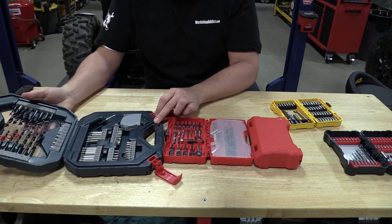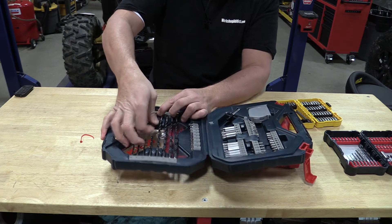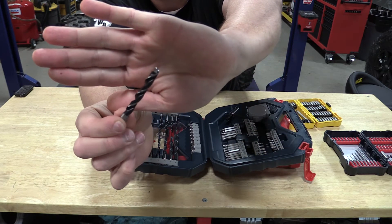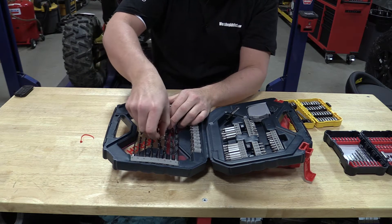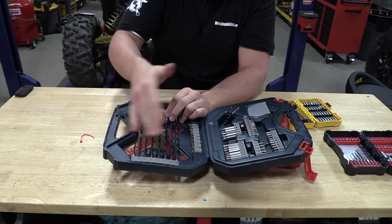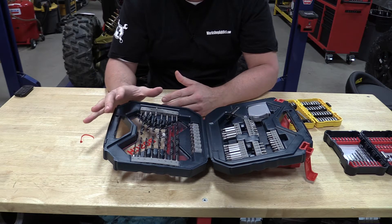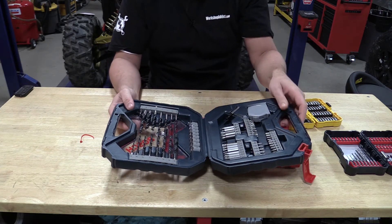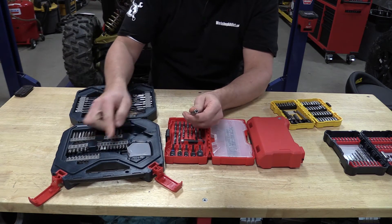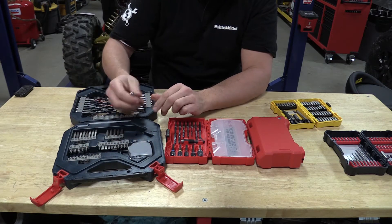If you're looking at a wood kit, this Bosch kit was very inexpensive and comes with a different style of drill — you can see the point at the end that works out well for wood. That's not going to work out well for metal, though they do give you a normal set of drill bits for metal. If you're drilling anything outside standard cold-roll metal size, these will wear out very fast. I do like that this kit includes a bit holder so you can use the smaller bits, because on an impact driver I don't like using the small screwdriver-style bits without one.